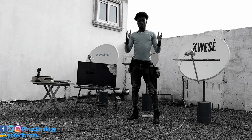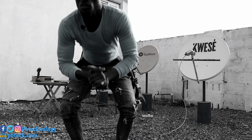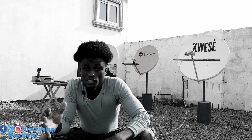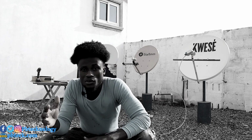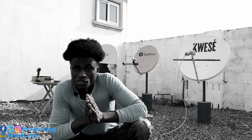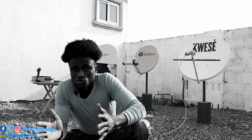Alright, so keep watching. To begin with, you have to know the satellite that you are tracking for, whether MULTITV, DSTV, or any FTA channels, and get to know the direction of those satellites. The first thing is to know the transponder of the satellite or the channel that you are to track.